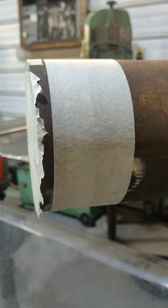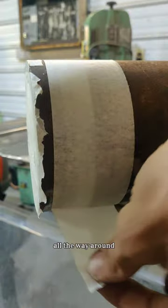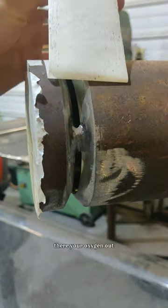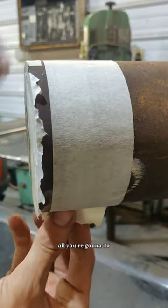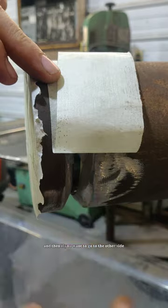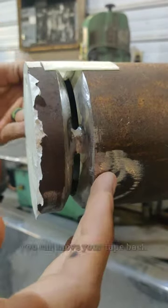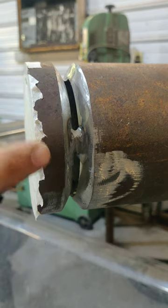There are about a half dozen different ways you can do this, but you're going to want your bevel edges taped all the way around. You can have that little spot up on top primarily to let your oxygen out. You can wrap this all the way around — if you want to start on the bottom side and come up your right-hand side first, you've got your breather hole up here in the top of the tape on the opposing side from where your argon's coming in. If you peel this tape back, you can weld that bottom quarter, then go to the other side, get it covered back up. The tape won't be super sticky after it gets hot, but it'll still work. As the root pass fills in, it's not so critical to have it taped up — you can move your tape back and weld the top quarter, same thing on the other side.